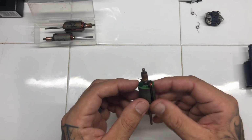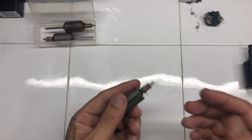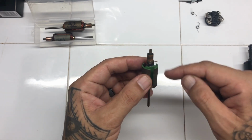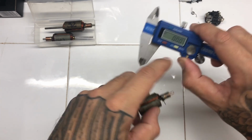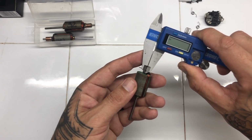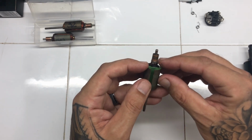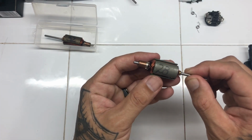And when I first started, I was doing a lot of research on the airsoft forums and just trying to work out what I needed for a Frankentorque and where I could get it. So what I was basically doing was buying motors, two of them at a time, and then on one of them I would pull it apart and I would cut the wire, and then I would actually unwrap it and count the windings, and then I would measure the wire diameter. So that there is 0.6 millimeters, and that had 32 wraps of the wire around the armature. So I know that was 32 TPA, and through all my research, I've kind of come to the conclusion that anything that's around 0.6 millimeter is around your 32 TPA, and your 28 TPA, you're looking at about 0.65.